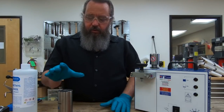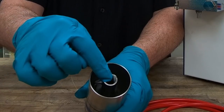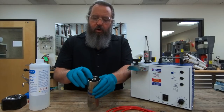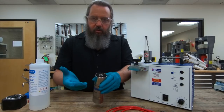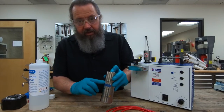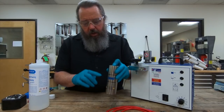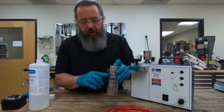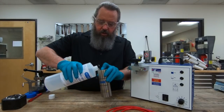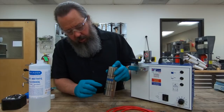We're going to now add flux to our booster tank. The booster tank has two chambers: an outer chamber and an inner chamber. The inner chamber has threads in it and is what gets threaded onto the stem of the machine — you don't want to get flux into this inner chamber. The easy way to handle this is to cover it with your finger while you're filling. Note that there is a minimum and a maximum level; you don't want to go above the maximum. I like putting the solution kind of in the middle, so start to fill up the tank.